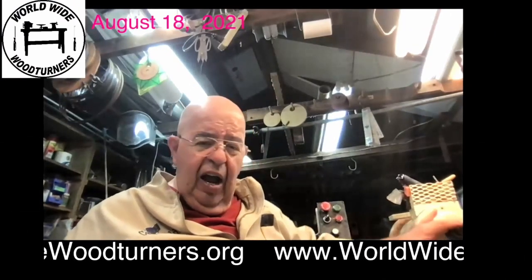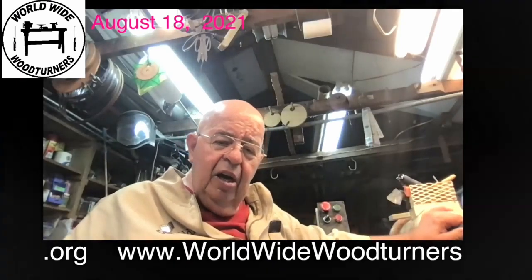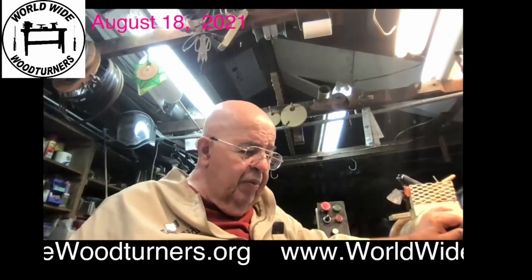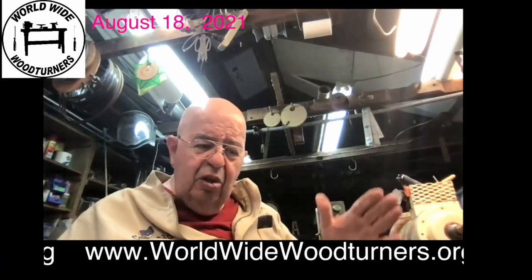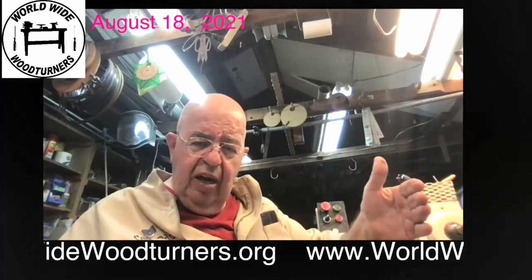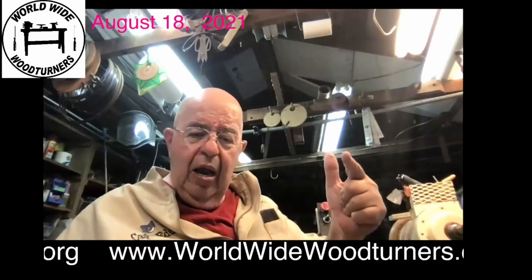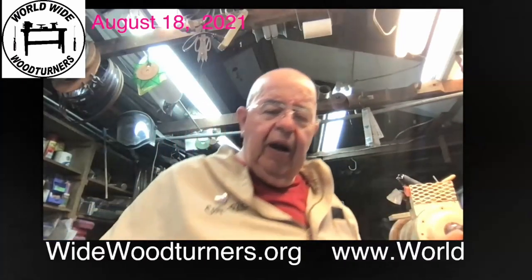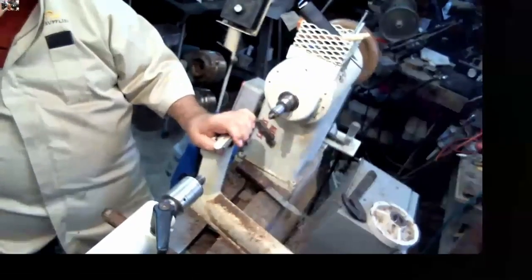Now, I can put this chuck in and slap it with a hammer and it'll be in my Morse taper. If my Morse taper is not clean, it'll be in there crooked, but it'll be in a Morse taper. If I cut towards the tailstock, I have a good chance that harmonics will set up and I'll pop it right out. Well, with the drawbar, you can't pop it right out. So the difference is what you prepare for. All right, now we have that done.